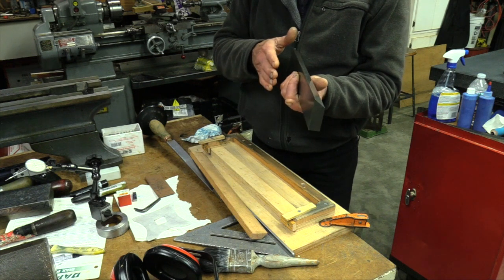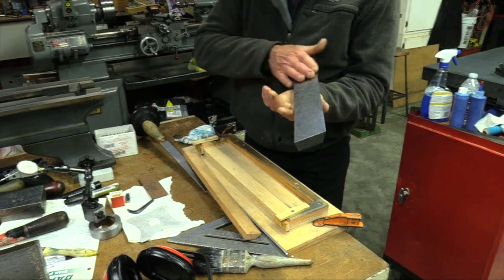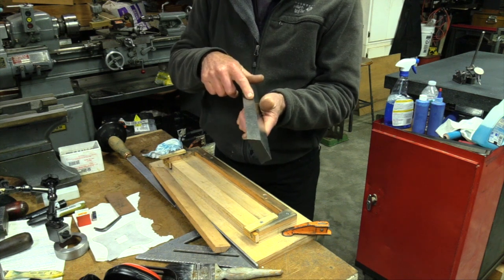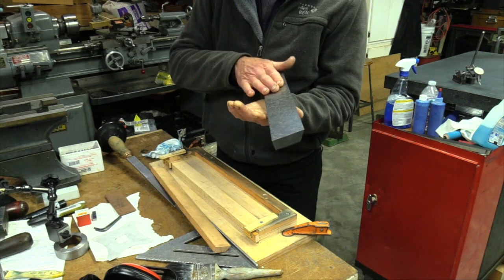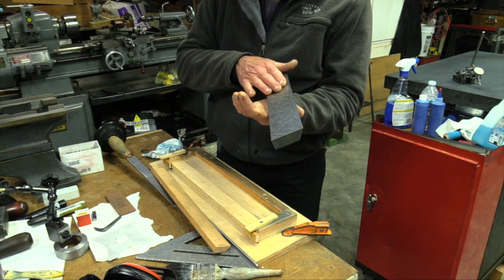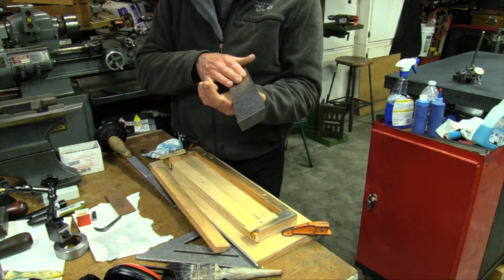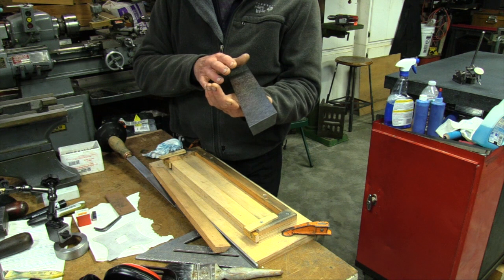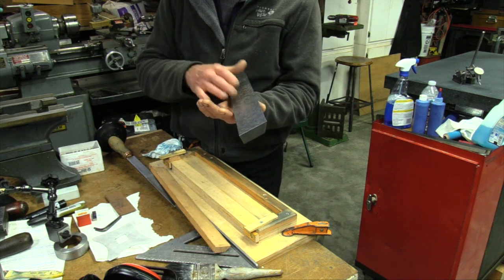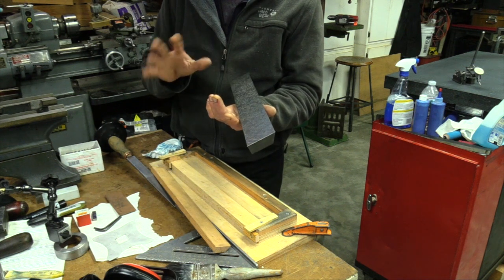When you're doing cast iron, or scraping multiple surfaces, you can't do just one, finish it, do the second one, finish it, because when you're working on this edge, as an example, this surface may change a little bit, which it did, slightly. Hinging. Oh, yeah. It's changed slightly. So you don't get one completely finished to like 40 points or whatever it is you're trying to do, and then go and do this one, because then you'll have to go back and do this one. Right. So you just tweak a little bit.